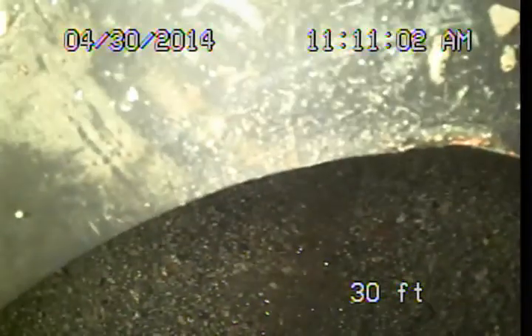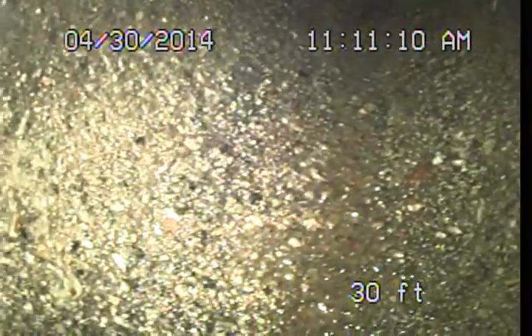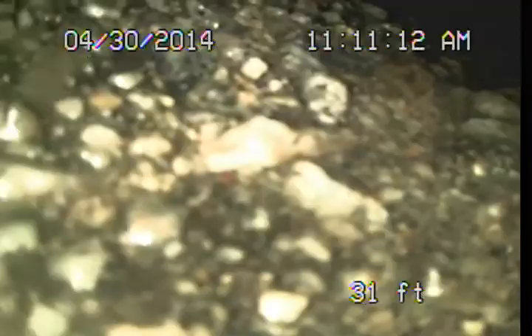We're going to drop down to the front of the yard and get into that other area we had described — the fittings weren't standard. This is a drop; we just kind of dropped straight in to the leading edge of that pipe. A little different viewpoint here — I have a guide on the camera to get it up off the bottom. You can see this downward turn kind of just goes into the top of the concrete. It's not a smooth transition, and then back to horizontal.